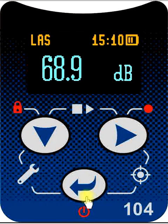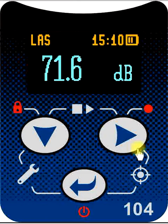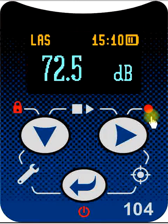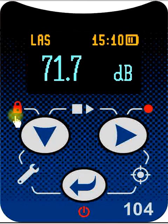For example, the enter key — if you hold it down for three seconds — turns the instrument on or off. The right button, if you hold it down for three seconds, brings up the voice note comment recording to add notes to the measurement. And the down key with the padlock symbol is how we lock the noise dosimeter prior to leaving it on the worker to secure it from being tampered with.